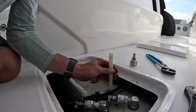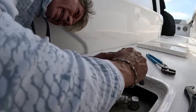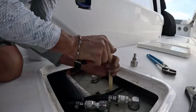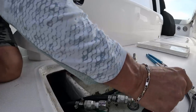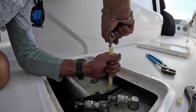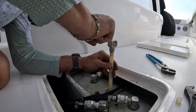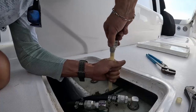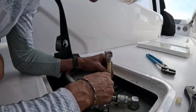As you can see, there's white residue from fuel — that's from when it does siphon up, seeping out around the collar. So what I'm going to do, as I said, is get about a half inch right to that ring line and cut that off — like that. Now I'll push this down into that nice and flat and full. As you can see, it's extremely tight now — a nice tight snug fit. It's not going anywhere. So this is the fix for that problem.